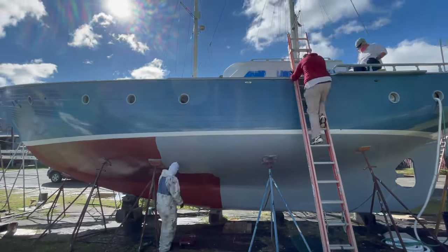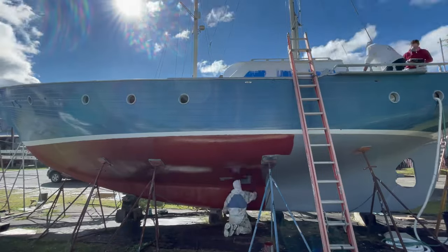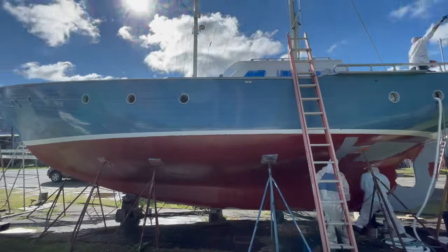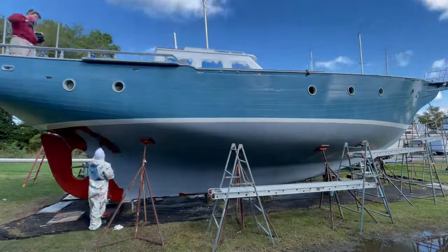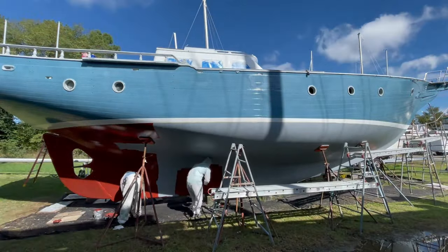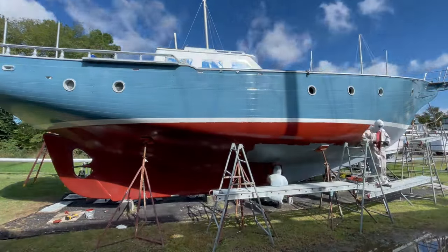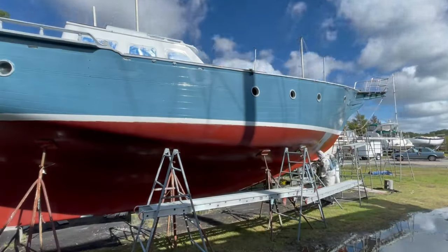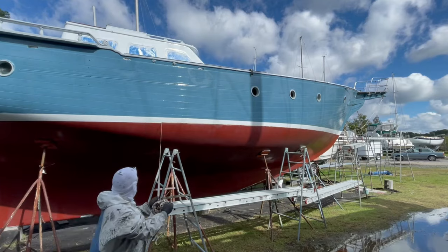The purpose of anti-fouling paint is to keep things from growing on it. Since the hull is constantly in the water, there are lots of different things that can attach and grow on it uninhibited. We call them hard and soft growth — classic examples are barnacles and slime. If someone says the prop is fouled up, that's what they mean. As growth builds up, it creates more drag, slowing the boat. Anti-fouling paint steps in to protect the hull and deter any hard or soft growth.